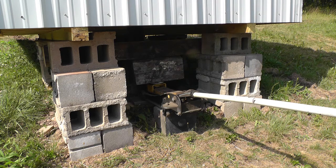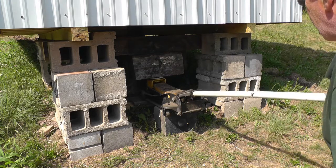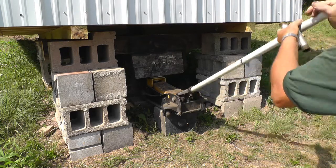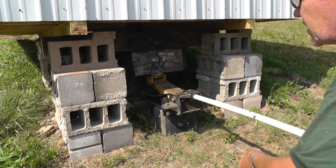Here's the setup for the front. I've got a little level spot for concrete blocks, set the jack on it — just the frame of the jack so the wheels won't move. The front of the jack is on a 2x4 and a 1x6. I've got a piece of blocking and a pretty hefty board underneath. She's coming up — you can see light underneath all the piers.